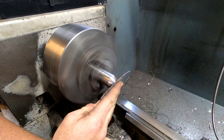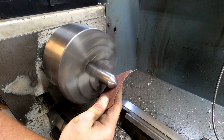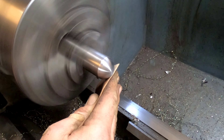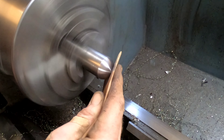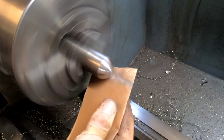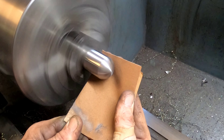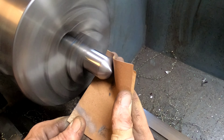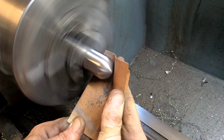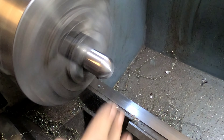I'm sure some of you watching what I'm doing here are a little bit nervous, and probably rightfully so. Let's talk about the do's and don'ts of this. What I've learned over the years: you never wear rings. You'll notice I have a ring on my finger, but it's a tattoo ring — I know of people that have had accidents with rings and you don't want to have that running with the machinery. Also, when sanding on the lathe, if you do choose to do it and take the risk, you don't ever want to wrap that sandpaper more than half around the work. Anything more than half can easily start getting sucked into the machine — it'll be like a big pulley system that's going to zip it in there, generally so fast you don't even know it happened.